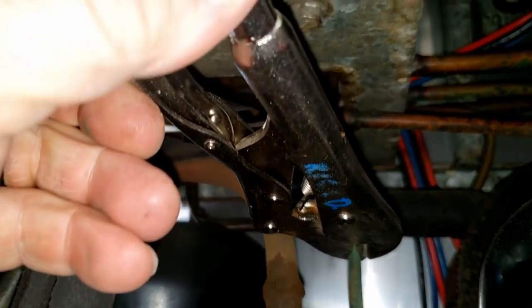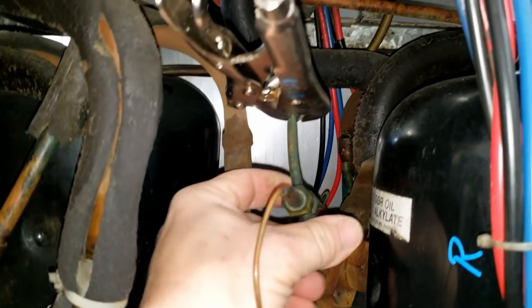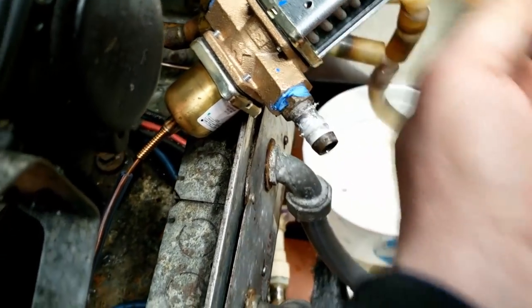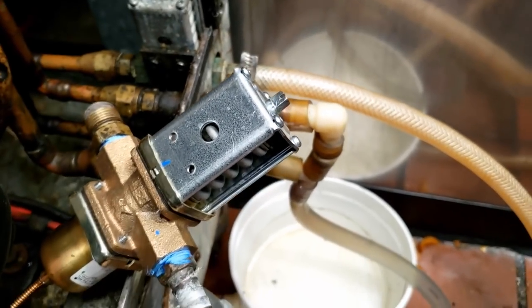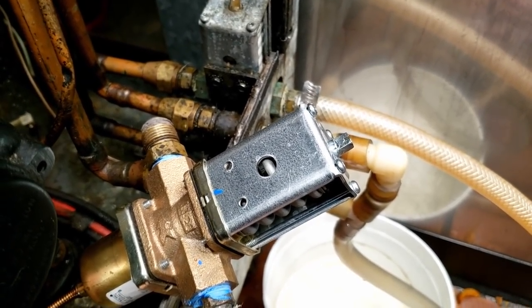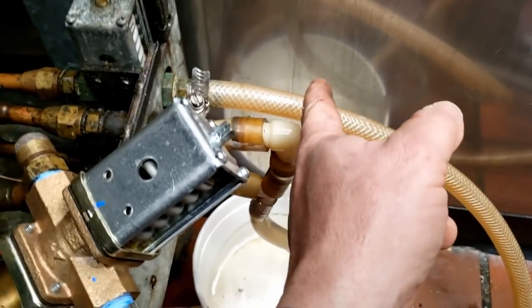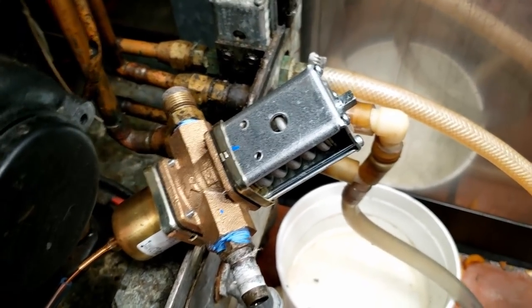You can see why this type is a little easier to do than the other — it gets in there a lot better. We'll get a backup wrench on there and get that thing torqued in, then bleed this off to make sure it's completely pinched. Went ahead and cleaned up the inside of that bell because you can see how bad it looks, and got the back side fairly decent. Got the fittings taped up, got sheathing on my tube so it's less likely to rub through on anything. I'm pretty sure this is supposed to go on the outside of the unit, but it's worked this long — why change it now? This thing is already beyond being replaced, so we'll put it back the same way it was rather than re-pipe everything.